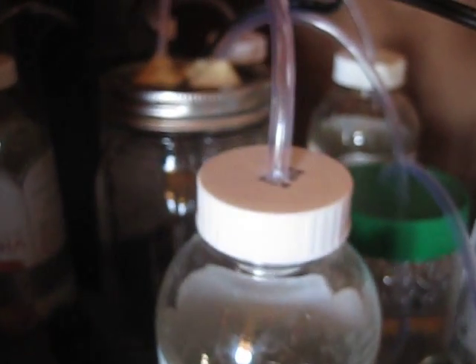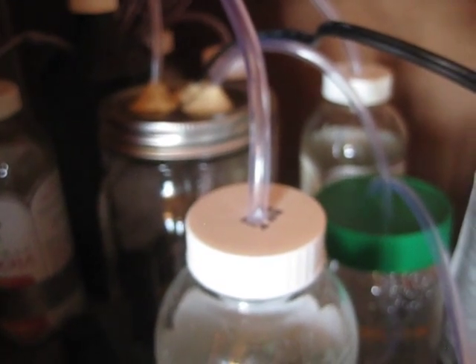This is my patented battery ventilation system. We've got 12 two-volt cells with kombucha bottles with the bottoms cut off and placed over the vent caps. These are standard forklift batteries with recessed terminals — PZS something something. On top of each cap, I drill a hole and put in standard aquarium tubing.